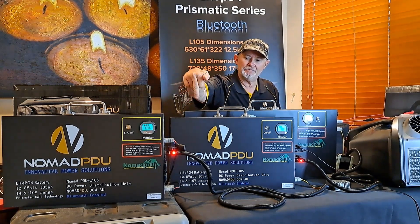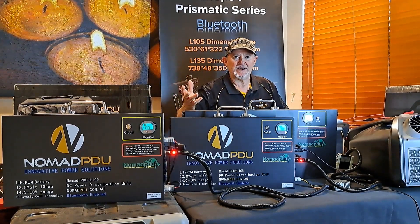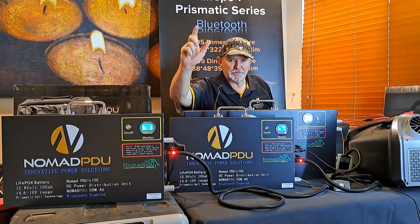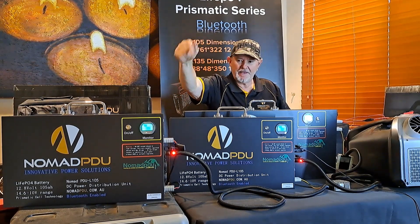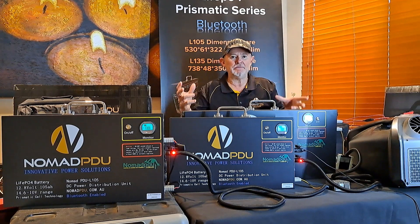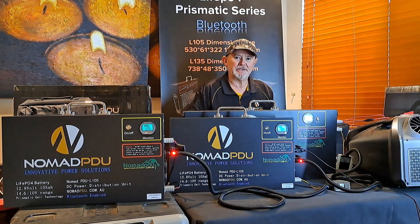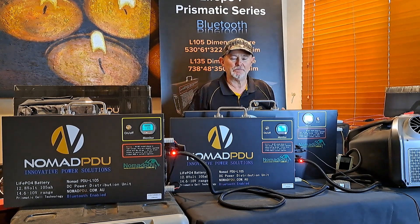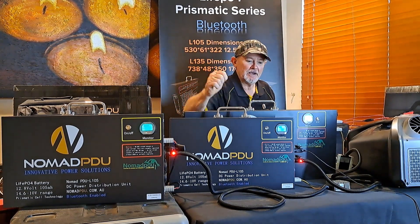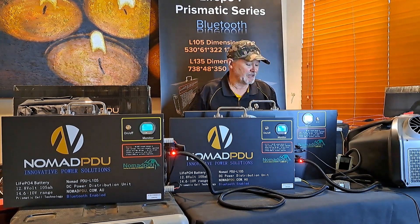You've got a fast USB and two DC sockets on the other end of the 135, and you can still use them. I'd suggest going 10 amp and 10 amp, and if you're filling it up at 30 or 40 amps with a good solar setup — maybe 400 watts or 480 watts with a Victron giving you 25 to 30 amps of regulated charge — you can have it charging one and feeding the step-up, and you've got yourself a full parallel setup with a 24 volt output without running in series.